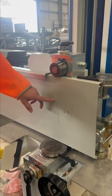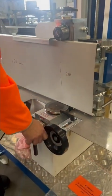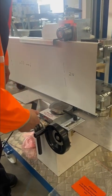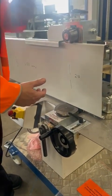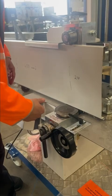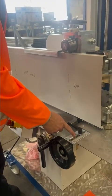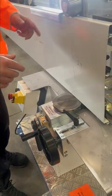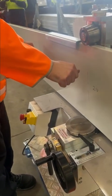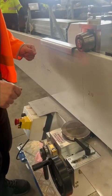People ask how I end up at 600 millimeters winding in — where does that come from? When you start winding in with the handle, there is only so much speed you can apply before you go too quick. So you make your first sample part and wind it at a speed where you don't oil-can the panel. Once you finish winding and have reached your position for the radius you want, you measure afterwards what distance was required to get there with that radius. There you have it — it's 600.